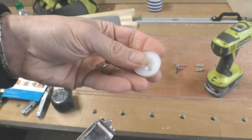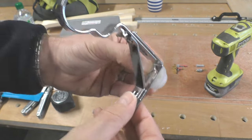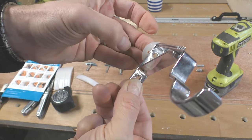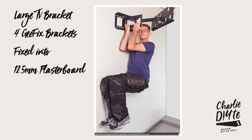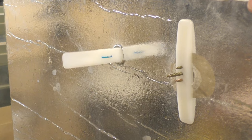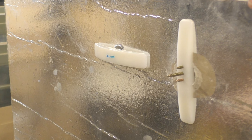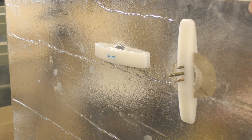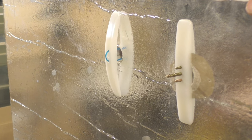The downside of having a wide plug — if there is a downside — is that if you're fixing curtain brackets to the wall you are going to see a little bit of the plug behind the bracket. However, this wouldn't be that obtrusive, particularly if you painted it the same color as the wall, and for most applications like TV brackets you wouldn't see a plug this size anyway. You can position the curved part of the fixing either horizontally, which is probably best for TV brackets, or vertically, for example when installing a curtain bracket.